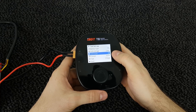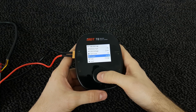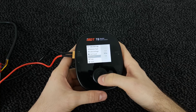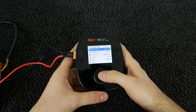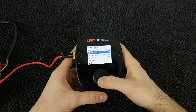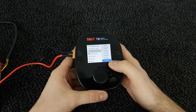Keep in mind that car batteries don't like to be charged at high current. A 55 amp-hour car battery should be charged at 5.5 amp — they like to be charged at a low rate. Going back to the main task settings section, the cell count is automatic so you only need to set the current. Here you can also change your detection sensitivity from 3 mV to 15 mV.